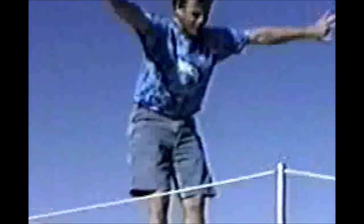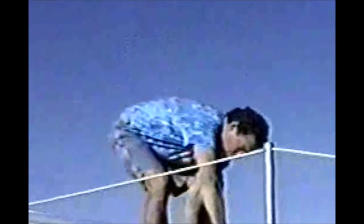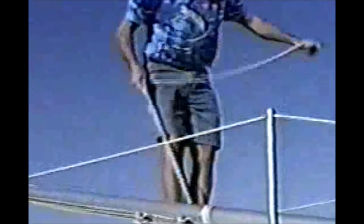Now preparing to raise the mast — I need the jib halyards. I've got two cleats on one side and one cleat on the other side, so I can fly three sails at the same time: two foresails and a main. I put an extra large knot in the end of the jib halyard so it can't go through the cleat. Take out all the slack, get it fully extended, then unhook the halyard from the U-bolt on the mast and bring it fully extended forward, setting it down right on the deck. Be sure there are no wires or ropes or lines under the mast where the mast will go onto the plate.